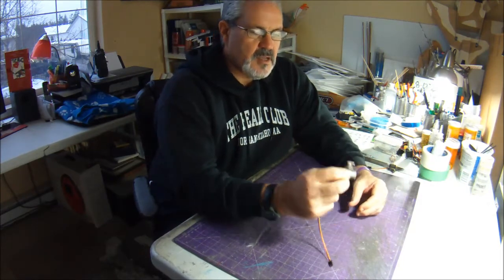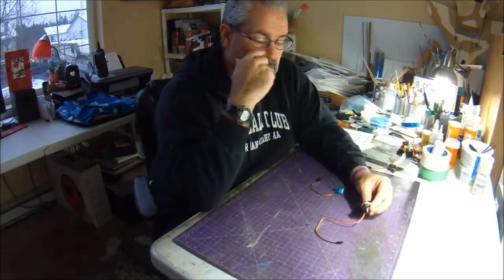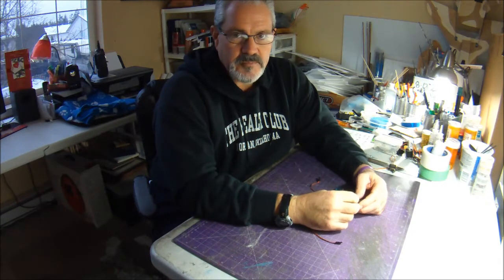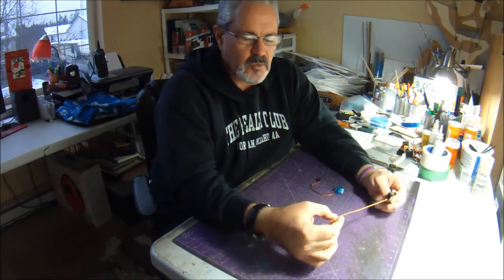So anyway, for my other planes, I was still using metal gear servos on the elevons. And for the ailerons and rudders I switched to using the 9-gram nylon gear servos. So that was a 16-gram weight saving right there. But my planes still were a little bit heavy.